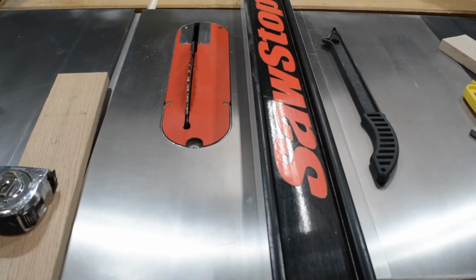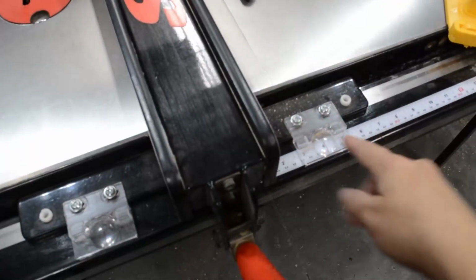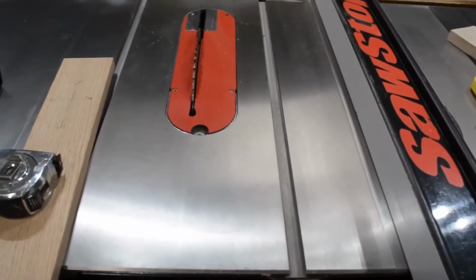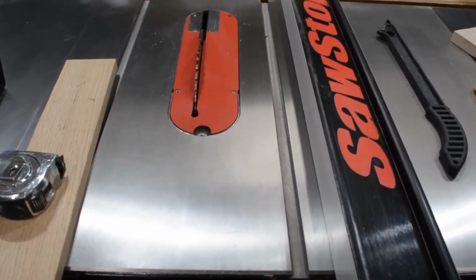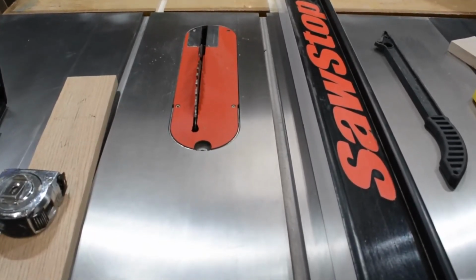The other thing to check is the ruler down at the front of your saw, which tells you how far your fence is from your blade. That's not always going to be accurate. That's more so true on a less expensive saw, but even on a more expensive saw, you're going to want to check that periodically and make sure that it's right on. My old DeWalt job site saw you saw a little bit ago, I've had that for 7 years. It does a pretty bang up job actually, but I still check on those settings when I take it out on a job site.